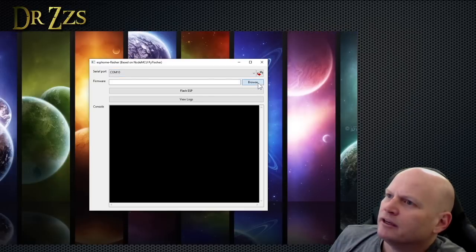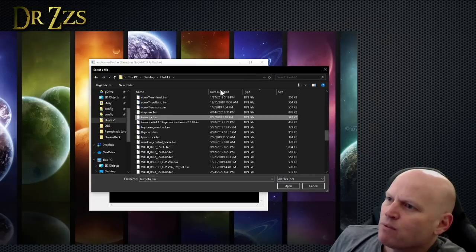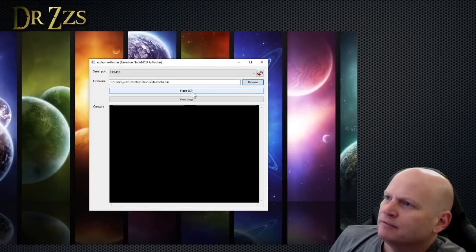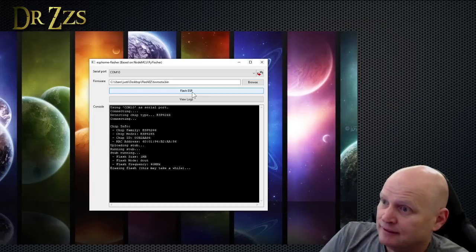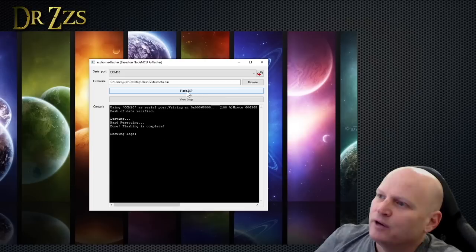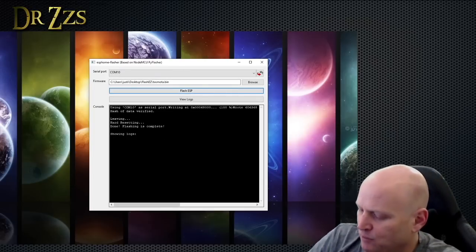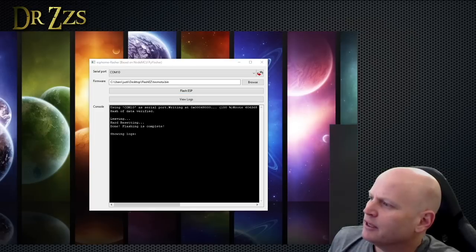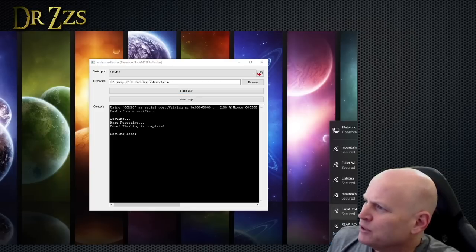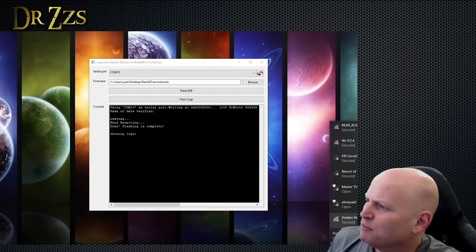Now, we go back here, browse. There we go. All right, Tasmota.bin. Now let's just see if it works. Let's just see if I did it right and we flash it. Bingo. It's flashed. It worked. Yay, it worked. Now we hopefully can go to my little network over here, which you guys can't see, and we should be able to find a Tasmota something.